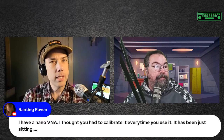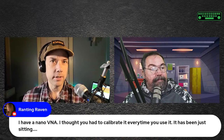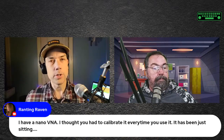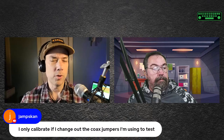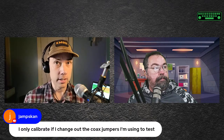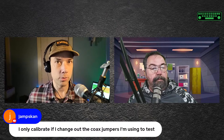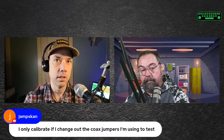So once you calibrate it, Raven, go in and save the calibration. That gives you five different choices to save it in. And so the good part about being able to calibrate it is that you are in control of what's going on, as opposed to the units calibrated at the factory. You don't really know where it was calibrated. So I can calibrate it for 14074 for the FT8 frequency on 20 meters, and then I can test an antenna in that range, as opposed to just calibrating it for 160 through 6 meters. And, you know, 100 points of data between 160 and six is spread out awful thin.